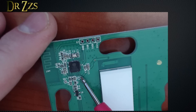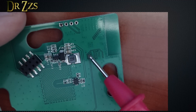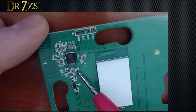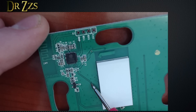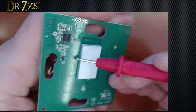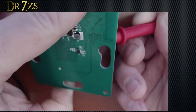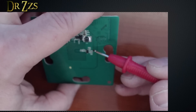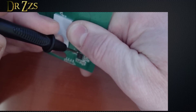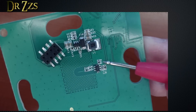That is GPIO0, and it pokes through to the other side of the board. It's the furthest one of this bundle of four — it's this one on the left side when it's upside down. It just travels a short distance and then goes back through to the other side of the board. Turning the board back over, the only thing it could be is this track right here. It looks to me like it's R10 right here. So that's the one I'm going to try. GPIO0 is this side of this R10 resistor.